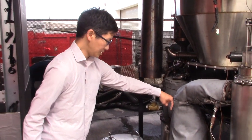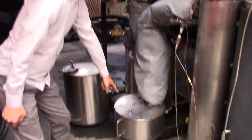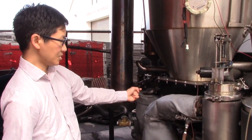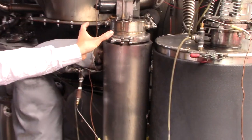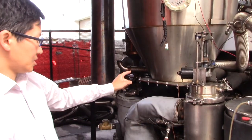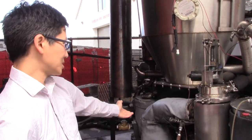The gas then goes into the cyclone. Under this insulation there's a cyclone, and that spins out the fine particulates that remain entrained in the gas. Those dust particles end up in this cyclone can down here. The gas then ascends a tube, without the dust particles, and enters this heat exchanger. This vessel is the first heat recovery stage on the Power Pallet. It cools the gas using the hot engine coolant. The reason we're doing that is that the hot engine coolant is hot enough to not condense out water, but it's still cooler than the gas coming out of the reactor, which comes out at roughly 500 degrees centigrade.